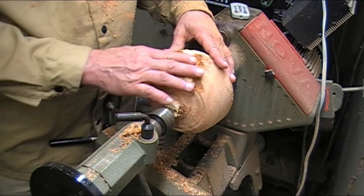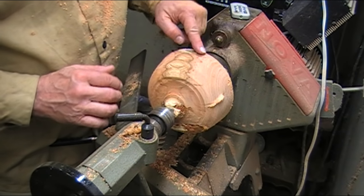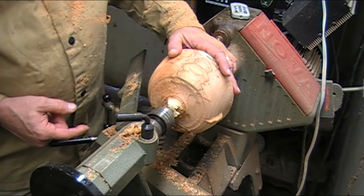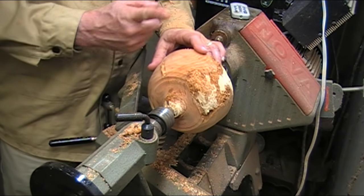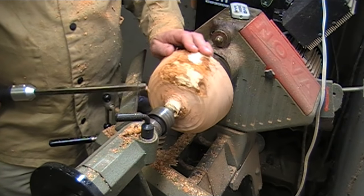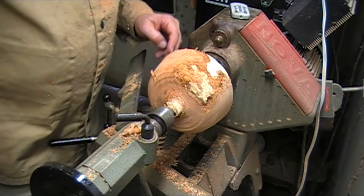All right, so this is all still punky and this needs to come off — this is all punky. I'm probably gonna slip out there — just cut this off. I use my parting tool. That's a wormhole, and the way it's cutting with this carbide is just bending it over instead of cutting, but I can fix it. It's getting smaller and smaller — let's do it.